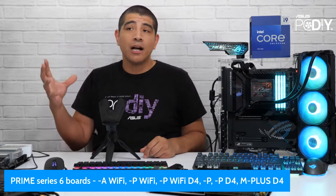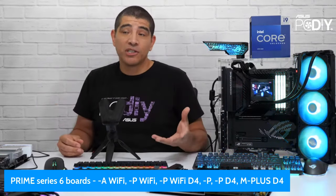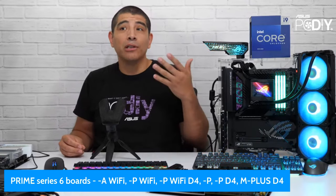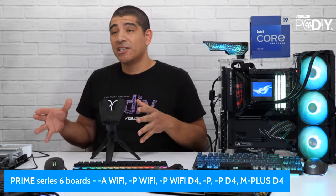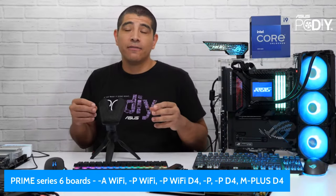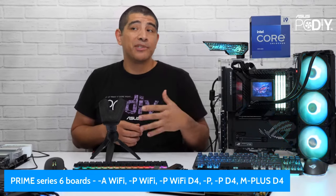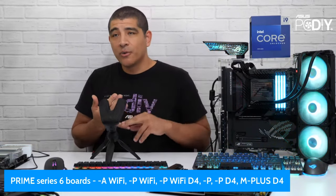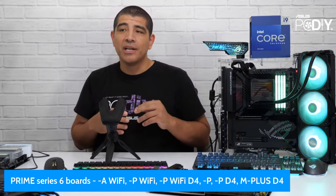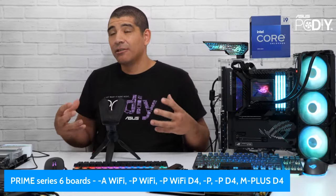We're adding in copper substrate layers in addition to that. You then go into more specialized motherboards, like on the Maximus, where we go to low loss series based motherboards. Then add in the complexity for PCI Express Gen 5 and DDR5. PCI Express Gen 5 and even Gen 4, compared to motherboards that didn't have that specification support, require specialized quick switches and muxes and redrivers. So the pure add-on cost of just producing the motherboard is considerably more complicated.